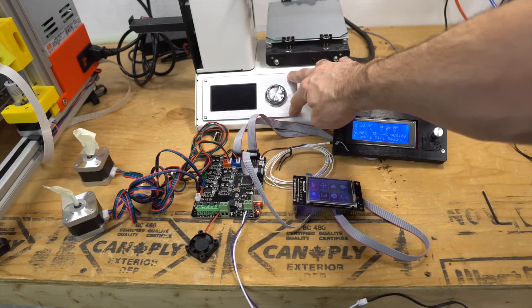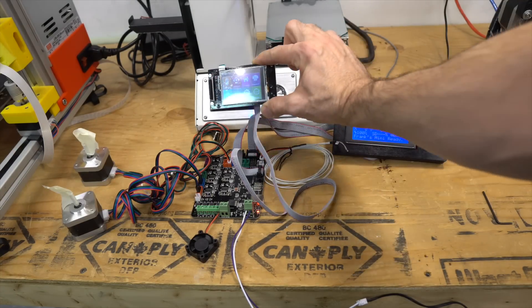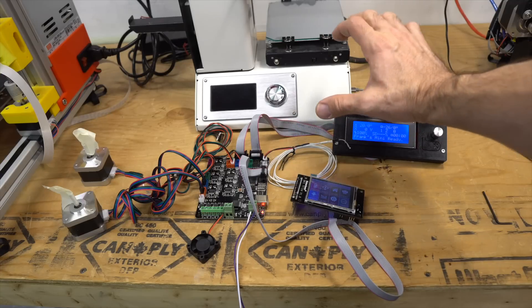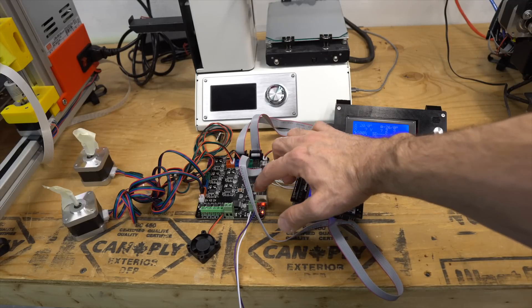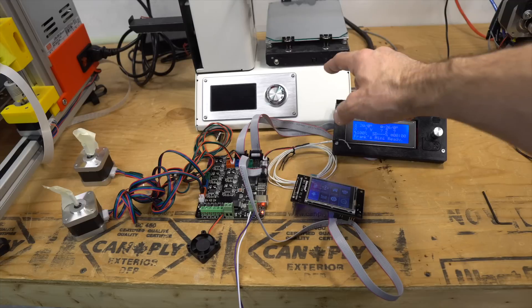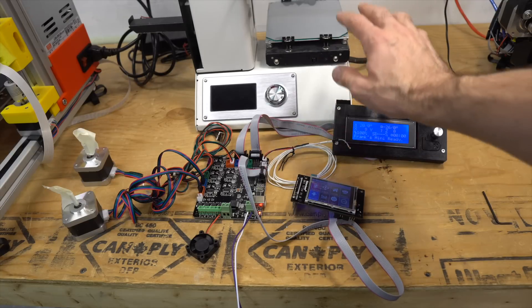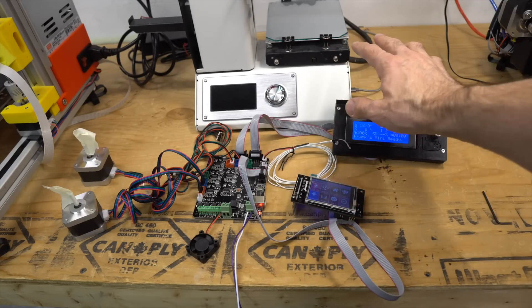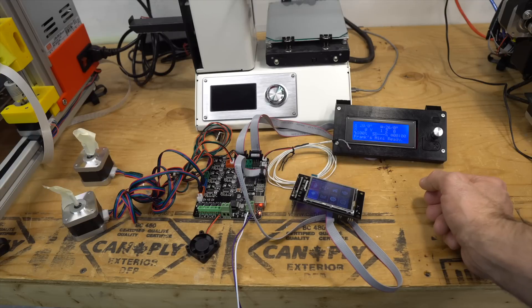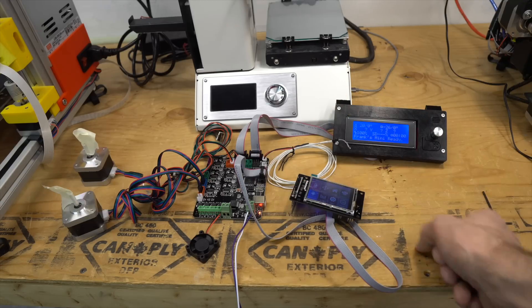Next I'm going to remove the face plate and make a new one in Fusion 360 to have this mounted cleanly. I'm also going to do a bracket — the original board is small, but I'll try to make a bracket so I can screw this board in place of the other one without needing to pierce any holes on the bottom, maybe just for the USB. Basically, I'm going to modify the Monoprice Mini to print better with Linear Advance, have more control, a nicer screen, and the full Marlin so I can add color LEDs and lighting. I'm really excited to finish that.